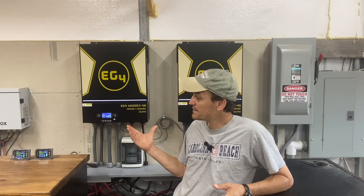What I'd like to go over first is: make sure whatever system you pick, if it's not going to be these, make sure it's scalable. This is more of a video to encourage people that it can be done. If you don't have the funds to get much started, you can continue to expand as long as you get the right equipment. If you get these, you can expand to four eventually. You could start with a few rack batteries or build your own and work your way into it as funds allow — that's exactly what we did. Solar is much cheaper than battery storage, so I would go heavy on solar.